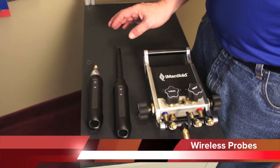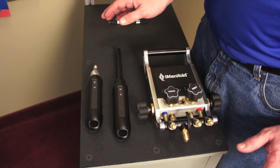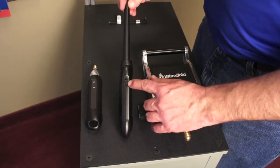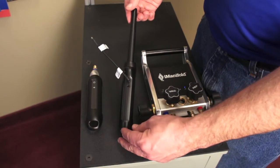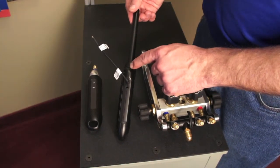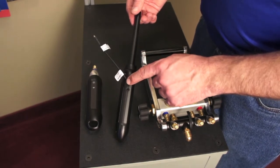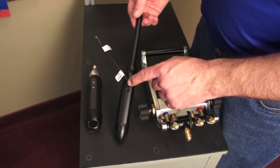Here's a sneak preview of what's to come. We have wireless probes coming out in the next couple of months. This is a standard wireless temperature and humidity probe — it reads temperature and humidity out of the tip. But we also incorporated two temperature jacks on the side that take standard thermocouple probes. So you can actually measure four points of data simultaneously: temperature and humidity from the tip, plus two temperature points from the side — useful for supply air ducts, wet bulb, dew point, or suction and liquid line temperatures.